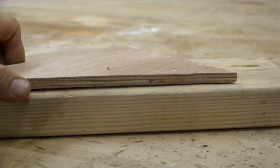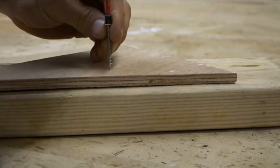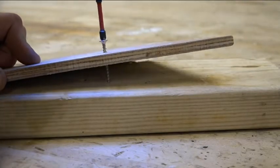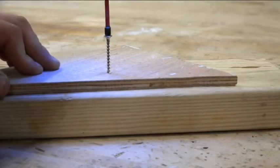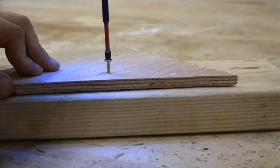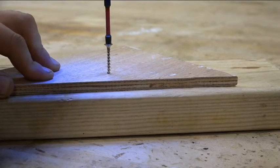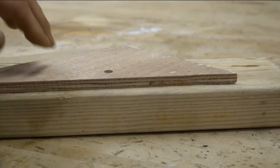Lastly, when screwing two boards together, sometimes even with a pilot hole, there will be enough back pressure at the beginning of the second board that the first board will be pushed away from the second and you will have a gap emerge between the two. If this happens, simply retract the screw until it is backed out of the second piece of wood and then reinstall. This time there will be threads from the initial pass for it to follow and they should come together firmly.